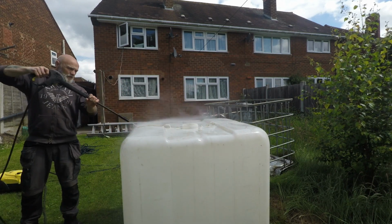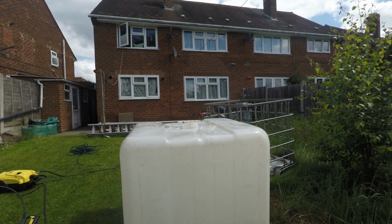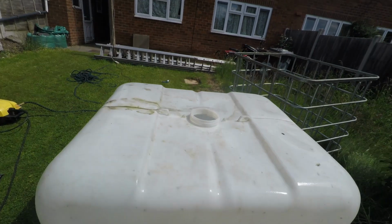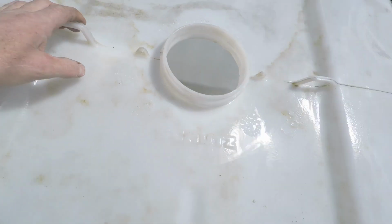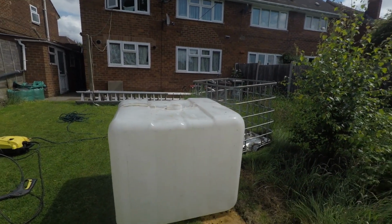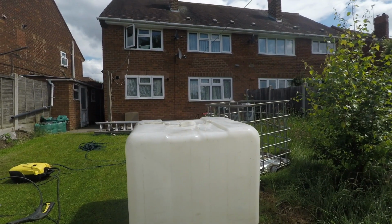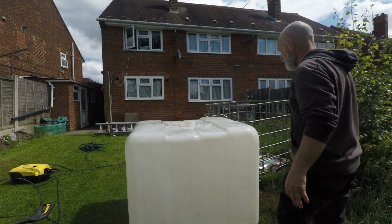It didn't go as bad as I thought it would, and it's come up a lot cleaner than I thought, apart from the outside. The outside's still a little bit riffy, but that's a lot cleaner now. All I would say is, if you are going to get one of these at the back of your tank, or any form of water catchment, like one of my subscribers said, cover the tank up, protect it from the sunlight, or you're going to be doing this, cleaning out green film from your tank.